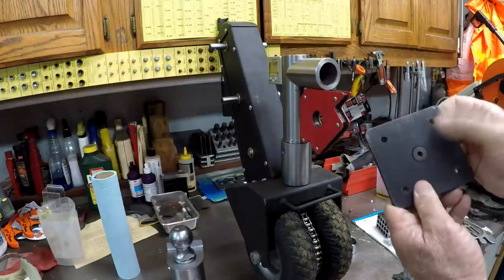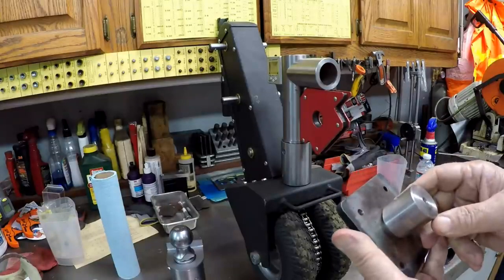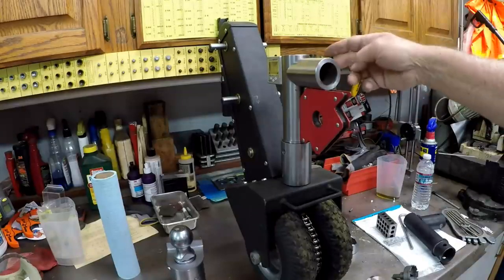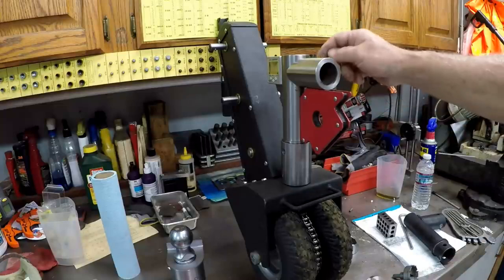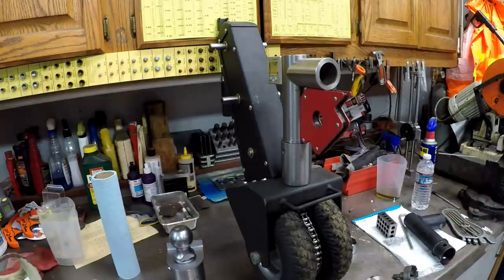And then this plate has already been on the trailer, and then I took it off and put the adjustable plate on. So this hole pattern is already on the trailer. So, been sitting here debating what to do, and I think what I'm going to do is give it a couple of tacks so I can take the magnet out, and then I can scribe some lines and get it perfect, cut it back off, then go and drill, and then go ahead and weld it up. That's the plan, I think. So we'll see.